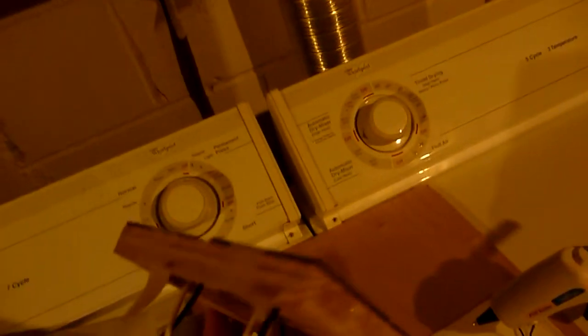This is one of my completed solar panels — almost completed, I should say. I applied tape to one side just to hold the solar panel secure as I applied the hot glue on the other side. Here's the little cell. What I found was that the cell has a little metal and this metal would come undone once you soldered the wires to it, so I had to use hot glue anyway to secure the wires to the panel, otherwise they'll just be flopping about.